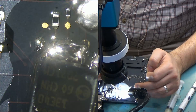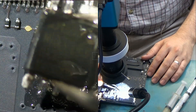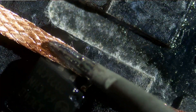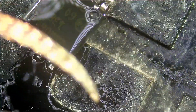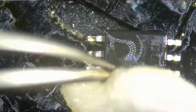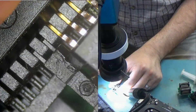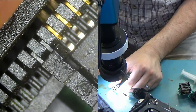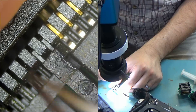The chip is moving — that's it. Let's remove that chip and clean out the pins so we can put it in the programmer. We'll remove the solder off the pins, seat the chip inside an adapter, and connect the adapter to the programmer.